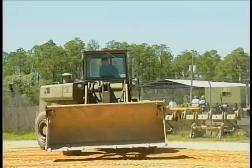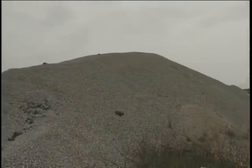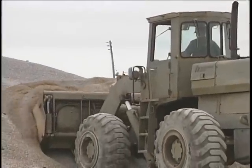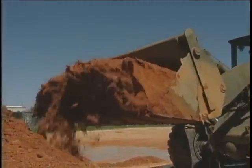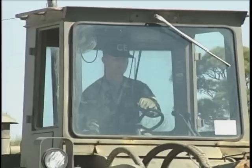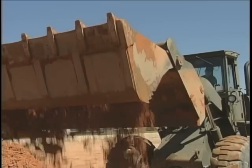The scenario just covered helped to clear up the small piles of material from a job site. The clamshell loading technique can also be used to load out of large piles of material. However, this technique usually isn't nearly as fast as the standard bucket loading technique. If you are handling material that is wet and likes to stick in the bucket, try the clamshell method of dumping material. It will normally work better than just tilting the bucket over to dump.